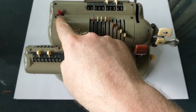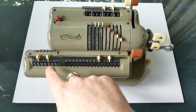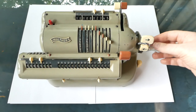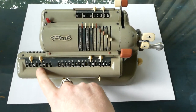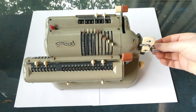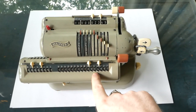When you clear the register this switch goes to the middle. This switch determines whether the counter will count up or down — whether it counts additions or subtractions. If the first turn you make is an addition it shifts to the plus side, so this counts additions. And if you then subtract it counts down, reversing the previous addition.